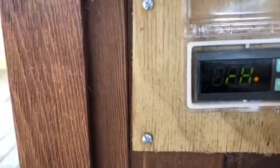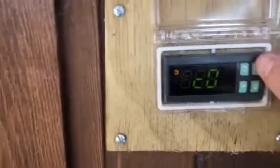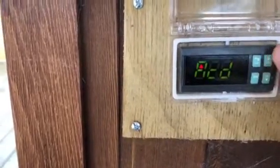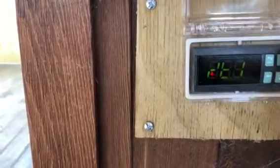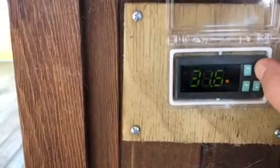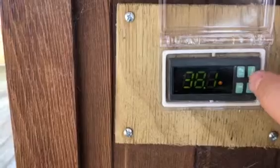R3 should show R2 value; go back out. R4 is 3.0, R5 is 0, RT is 0, RH is nothing — just leave RL, RH, and those all alone. C is compressor settings — don't worry about those in this case. D is defrost settings. Moving through the primary configuration, serial settings and similar — don't worry about those either. Then there's ST coming up — press Set and I want to move this up. You can press repeatedly or hold it down and it'll go slowly then speed up until you get close to your set point. I want to set it to 38.